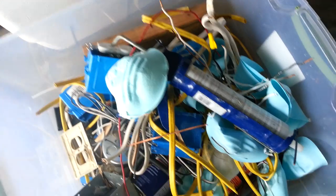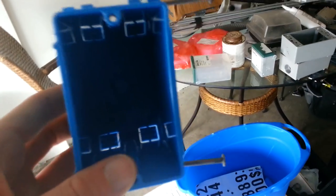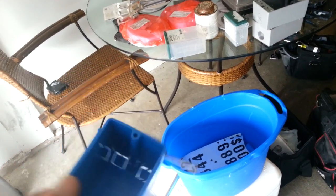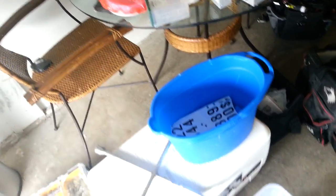Here's a 4-0 nylon box. When doing residential, they also have cut-in boxes — I don't think I have one. Basically it's like a single-gang blue box that has wings on the corners. You can cut it into plywood or drywall on the outside of the house, put it in the wall, and those little wings tighten up. That's known as a cut-in box for residential.